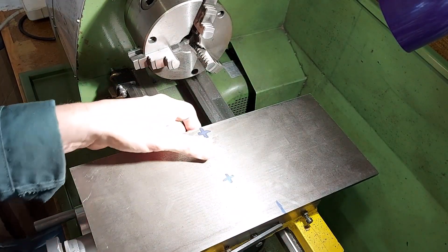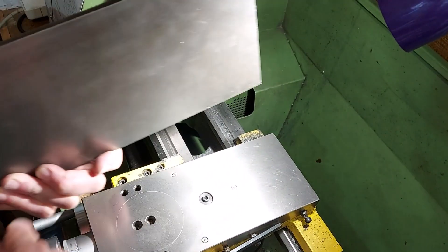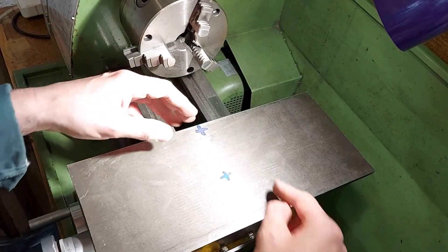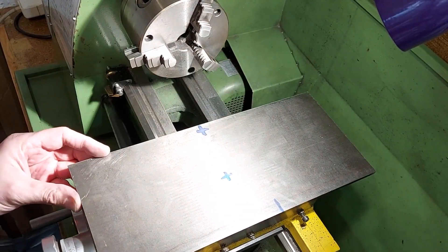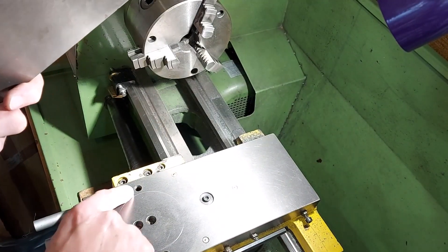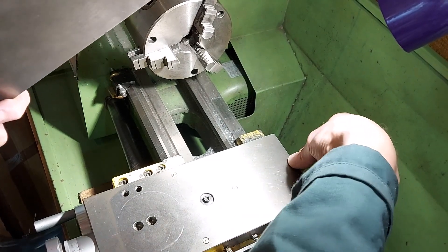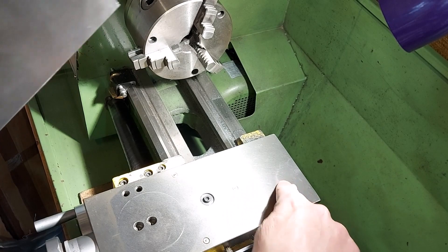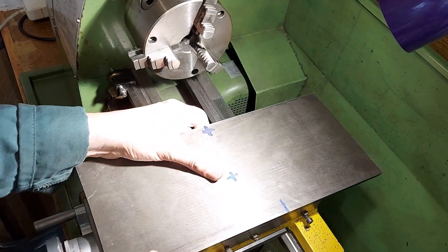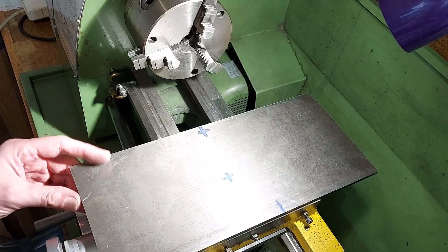For the actual plate that's going to sit on the cross slide, there's a bolt whose head is proud, so I'm going to machine a slight relief into the plate. I think I'm going to cut it here because it needs to go just beyond center, but only just, because I can move the whole thing once it's bolted on. I'd like to use the existing fixings but I'm definitely going to have to put one in the back in the center, through the table, so I can bolt this down nice and firm. I'm going to have a couple of pivot points for a start.